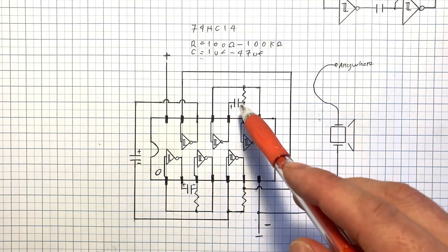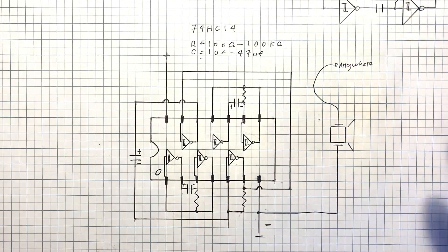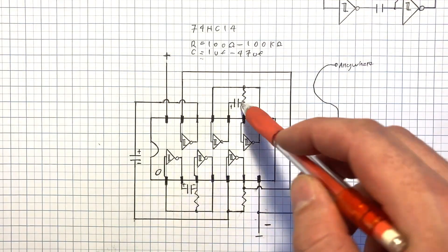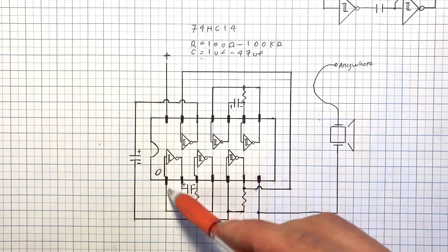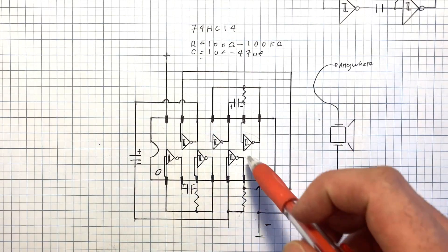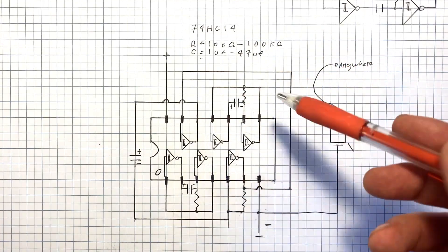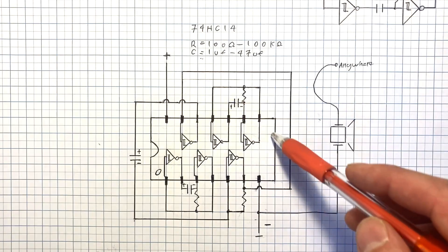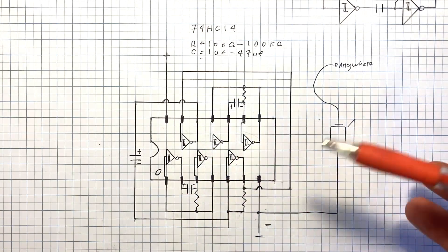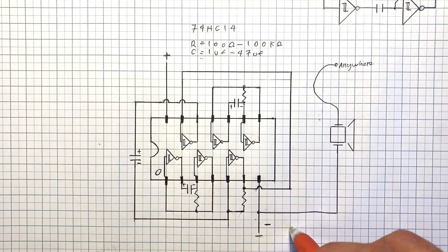But it does have an indirect connection. If this is powered from a small solar cell, solar cells can only produce pretty small current. So when one of these is switching, it'll take a lot of that current for itself and it'll disrupt the ability of these other ones to switch. So if we have these all fighting for current on a very low current supply, they'll kind of go in and out of phase with each other. Some will be able to run for a while and then other ones will take over, and they'll fall into these crazy resonances which we can use to produce sound. That's where the interesting behavior of this circuit comes from.